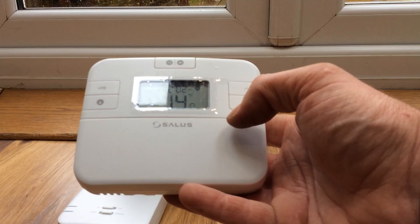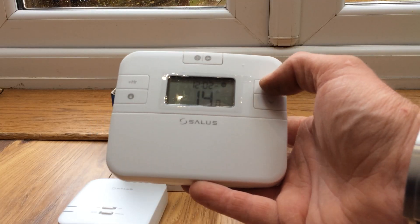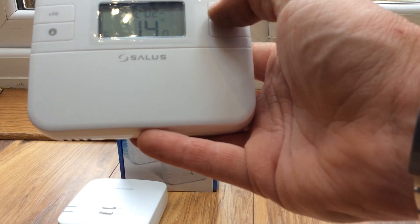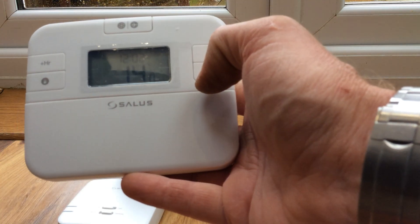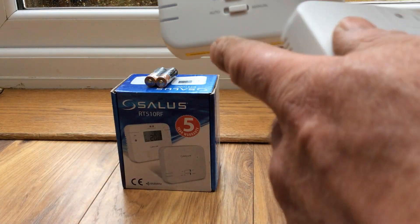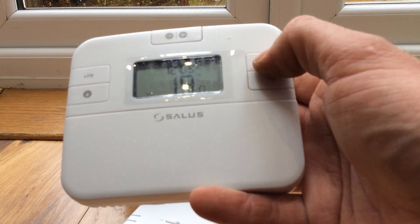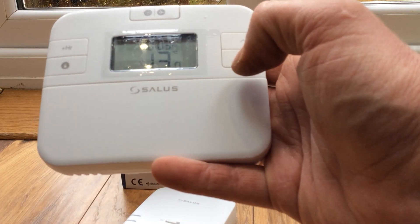I haven't set the weekends yet. Looking at the front now, it's saying 14 degrees — it just came out of my van and was a bit cold. The thermostat thinks it's 14 degrees. If you press the up arrow you'll see a frost symbol — press the frost button once to clear the frost function. Now press the up arrow and take it to 19 degrees; it will send a signal to the boiler to bring it on. If you walk in and you're too hot, hit the down arrow, turn it down to 13 degrees and it will go off.